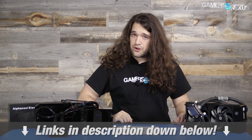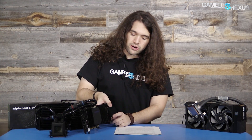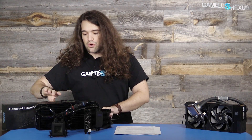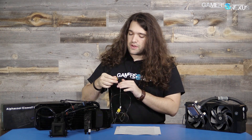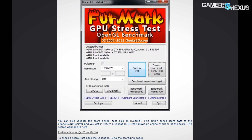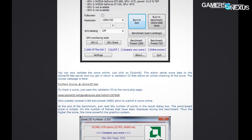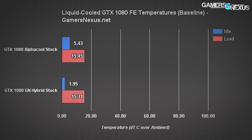Getting into the testing — our full testing methodology, as always, is defined in the article in the description below. You can click that link for the full review, some extra tests, and the methodology. We've connected more than just the normal software to read the GPU diode temperature. Attached to this video card are two thermocouple probes — one goes to the MOSFETs at the third MOSFET up from the bottom, and the other goes to the back side of the PCB where there's a hot spot. Starting with a baseline thermal analysis, this simple test runs Furmark for just 25 minutes, all automated with scripting written in-house.